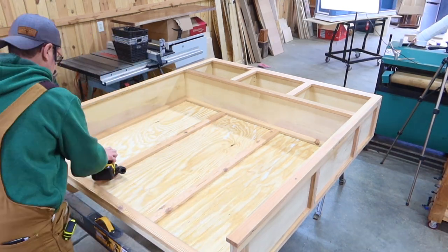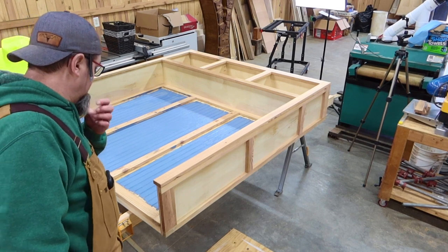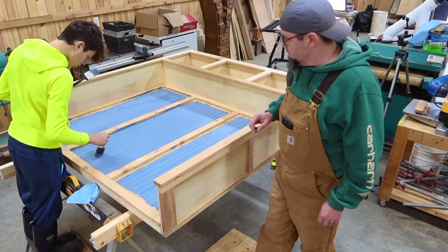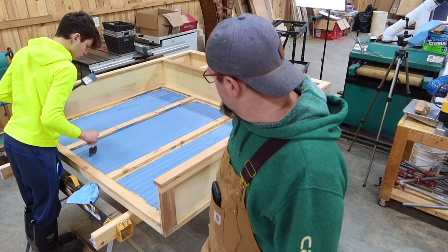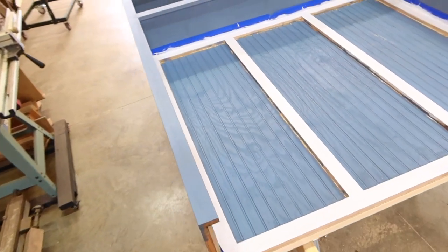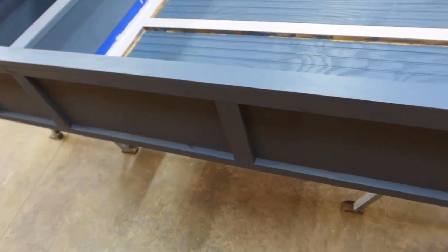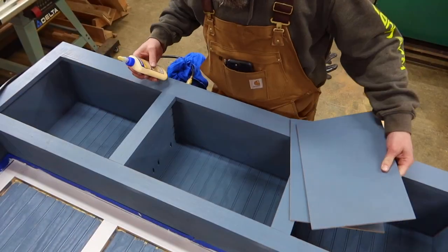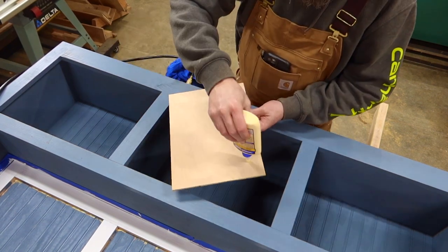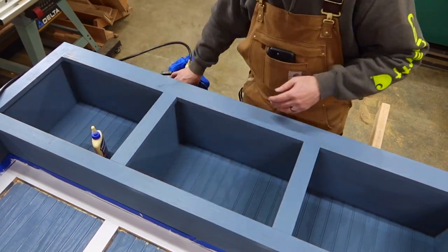After filling in some nail holes with wood putty, we give it a little sand and she's ready for paint. If there's one thing I cannot stand, it's painting — I would rather sand than paint. So this is where you get the help of your last born child, and he did a good job. Don't worry about right next to the boards on the inside because that's all going to be covered with our trim. To cover up my pocket hole screws, I'm just going to cover those up with some plates — this is just quarter inch ply. You could use plugs, but that would take a month, so this is how we did it.